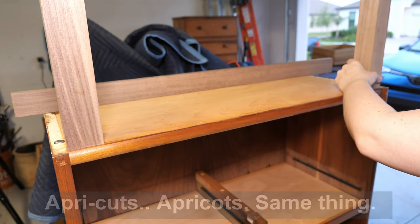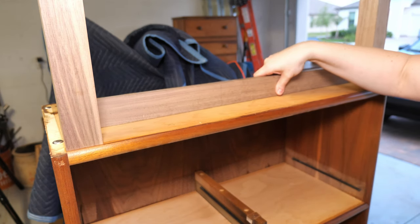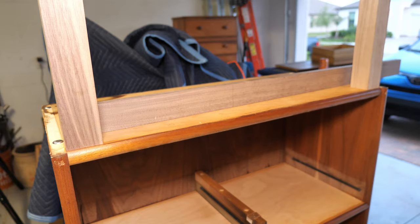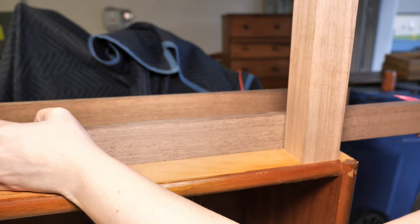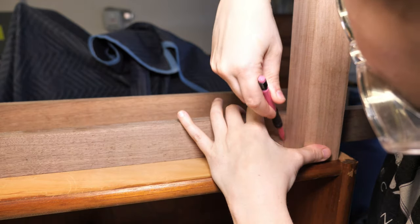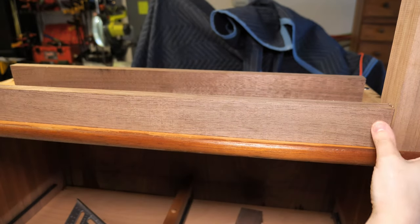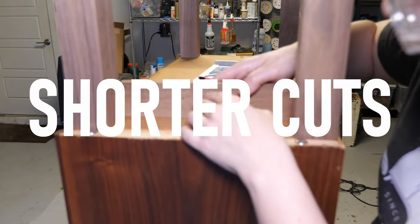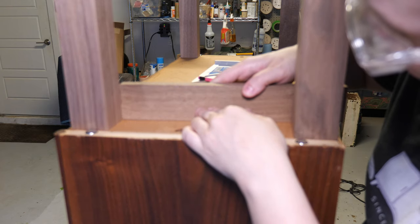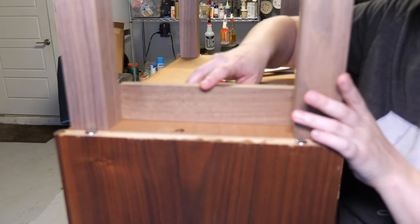Next I make the longer apron cuts. I align them behind the front legs after I put them in place to make my mark. If the ends of your lumber are rough, I recommend shearing off the end to make it smoother before making this cut. Once the first piece is cut, I transfer that to the back piece and make the same cut. Always check and make sure they fit according to what you envisioned. Remember, I'm not using a tape measure, so making the longer cuts first means you may have leftovers for the smaller parts.